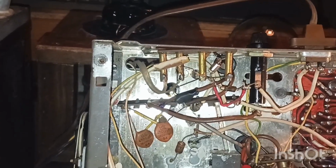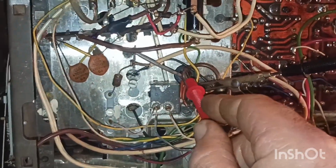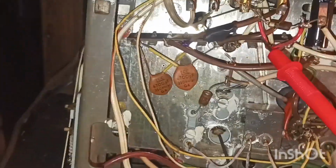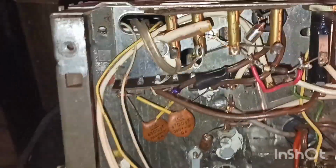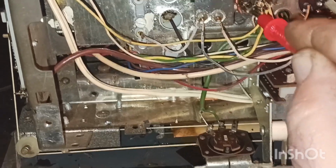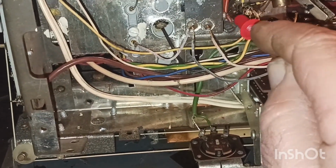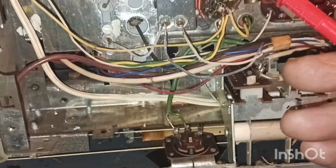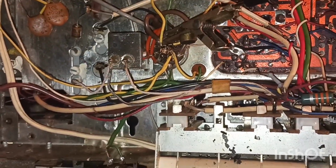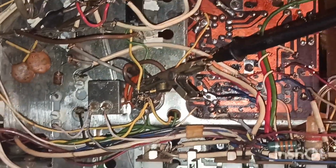These two red wires and these two brown wires are coming off the transformer, which is right here. See if I can get it in right here. Let's go back up here real quick. This brown wire and this brown wire go into the transformer, and then coming out of the transformer is this brown wire, this one, and these two red ones. We should be getting some kind of voltages. I would have thought we'd get our 40 or 50 volts here, which may not be 40 or 50 volts. It's a transformer, so it may have like 4.5 volts for the filaments of the tube, and then 90 volts for something else. But we're not getting any voltages.